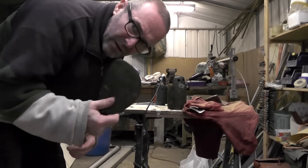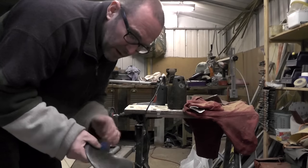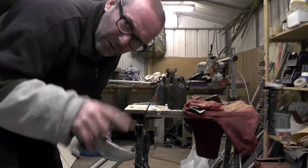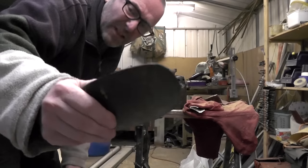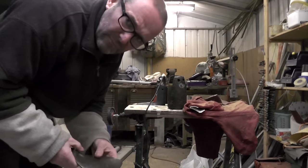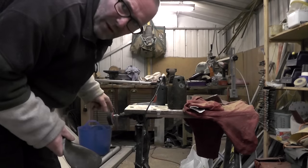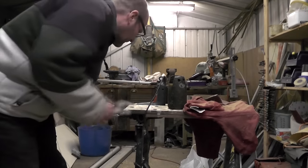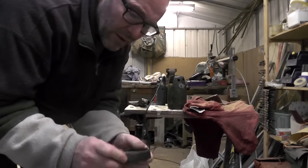Got the propeller off, going to try and clean it up. In the past - the one other occasion I did this - I used one of those flap wheels, kind of emery paper on a rotary wheel, and it did a good job of getting this kind of build-up off - a thick layer of crud. But it was almost too aggressive. So this time I thought I'd try a buffing wheel I've got, which I bought for doing the same propeller, putting a mirror shine on it. There's quite a hard, aggressive wheel in the set. I bought a cheap kit off eBay for like a tenner that came with three mops and a few different waxes. I use a very old Black and Decker drill - probably thirty years old - in my very old Black and Decker Workmate.